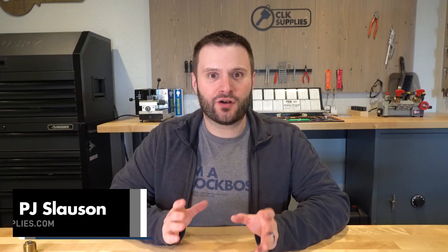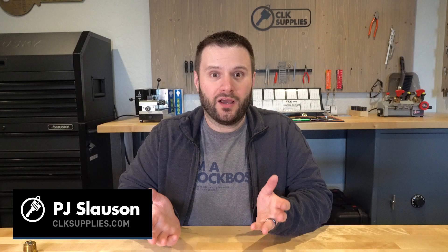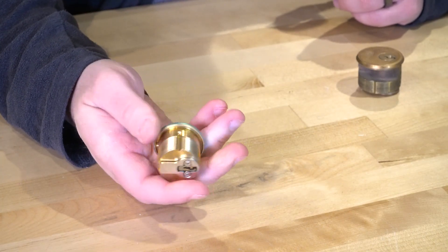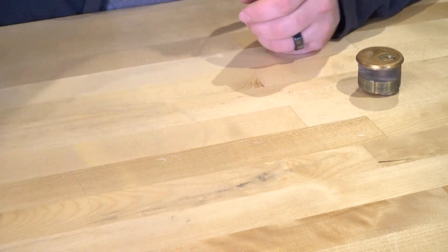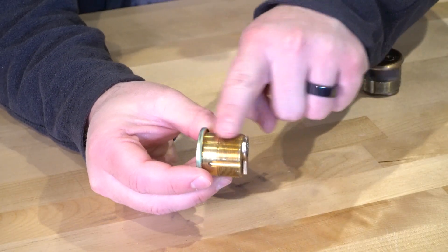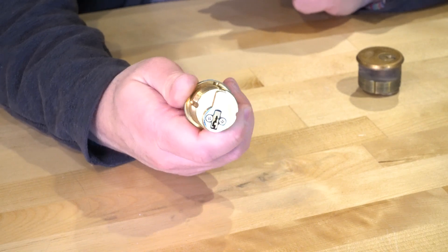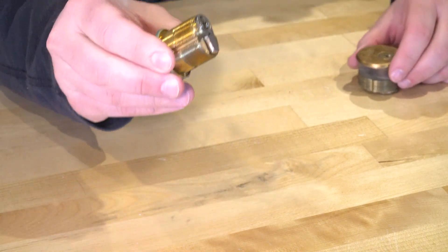Since these cylinders are not made, we're not going to be able to buy one to replace it. So let's talk about what is made. What is made is your standard one inch mortise cylinder. This one right here is your standard inch and an eighth length, and of course the diameter of this cylinder is one inch. But if you were to put this cylinder into an inch and a half hole, guess what's going to happen? It's not going to screw in.